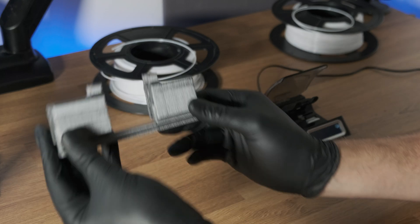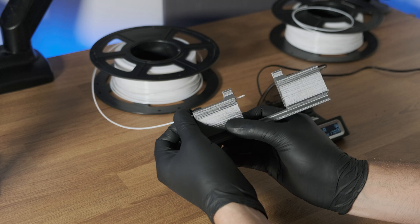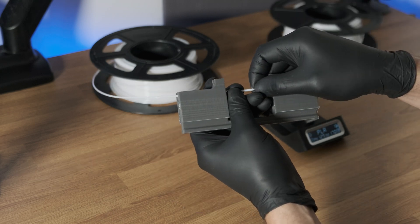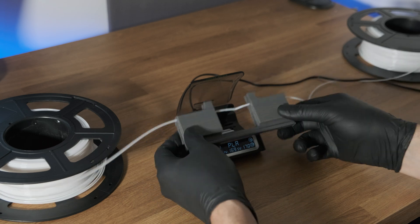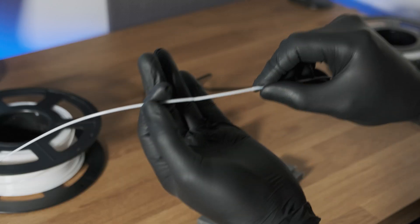The first design I tried was a type of clamping system where you thread a spool into each end, then connect them in the middle with the PTFE tube. It was a much more manual approach, and after trying it, I realized that I couldn't keep it steady enough at the end, which caused the filament not to weld properly together.